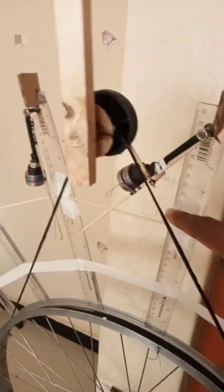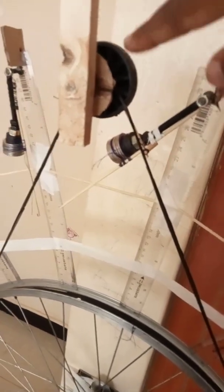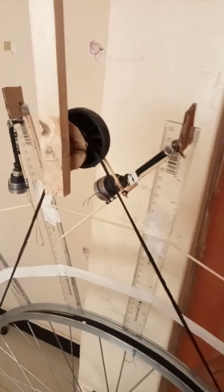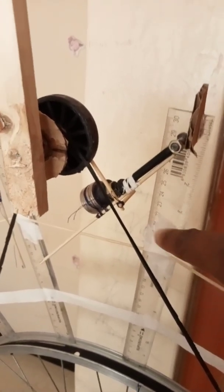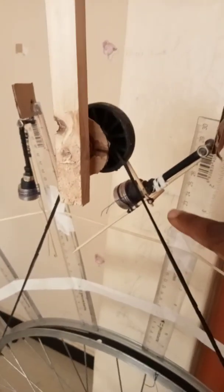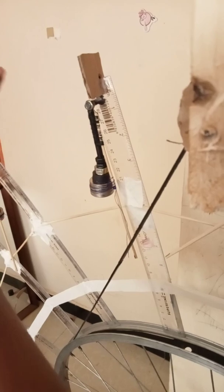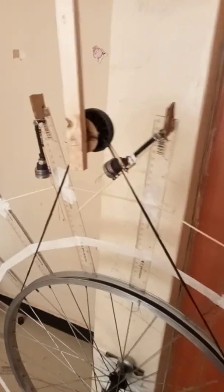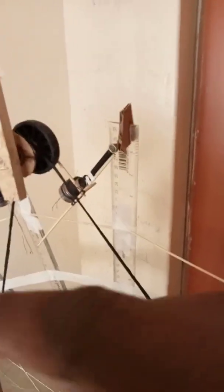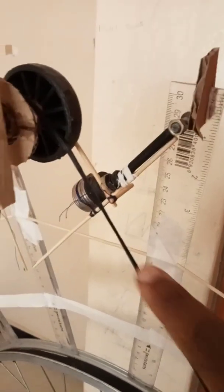I have also considered the path required to lift the weight, since the weight will not be lifted straight but rather it will be rotated through an angle of 180 degrees. So I have also used the trapezium rule to estimate the torque throughout the curve of 180 degrees, because the torque varies. When the weight is pointed towards the ground, to move it initially requires very small torque. But as it comes to an angle of around 90 degrees the torque is maximum, and continues to decrease as you move towards the 180 degrees. Since the torque is in a curve form — from a lower value, going up to a maximum value, then going down — I used the trapezium rule to estimate the torque throughout the curve.